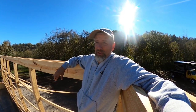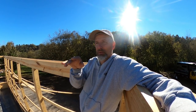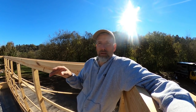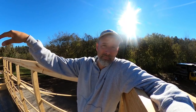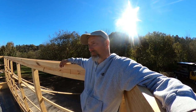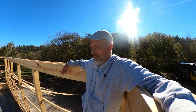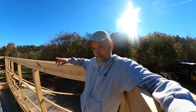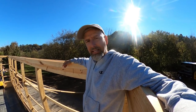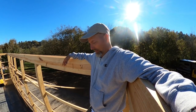So when we go to put the ceiling in, I'll lay out the flat part of the premium ribs, so I'll have to find the distance for that rib and then get that to the closest to where I want those three lights, 15 boxes to go, plus the five for the garage doors. And we'll lay those out and cut them in as we go. But really great on him to let me do that. And we'll leave him an access hole in the cover, which I need anyway, because I'm going to do blown-in insulation up in the ceiling eventually.